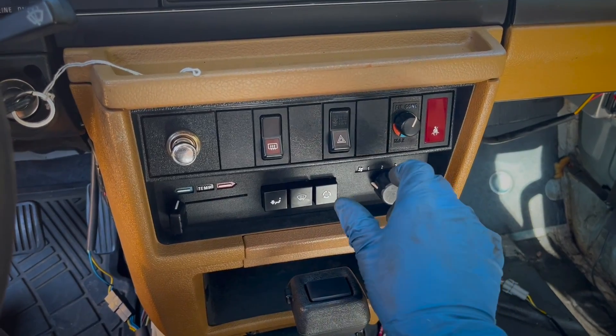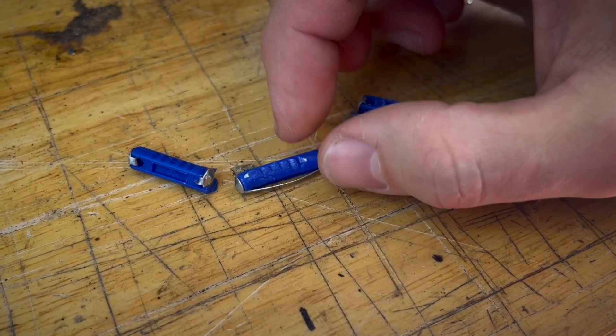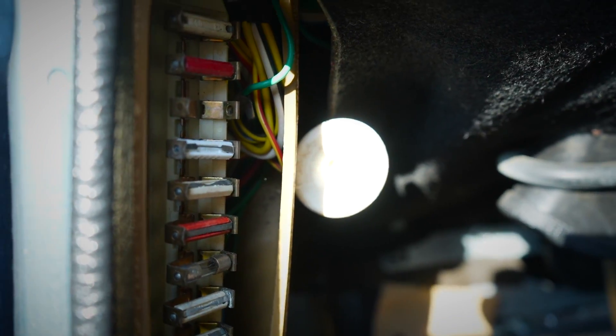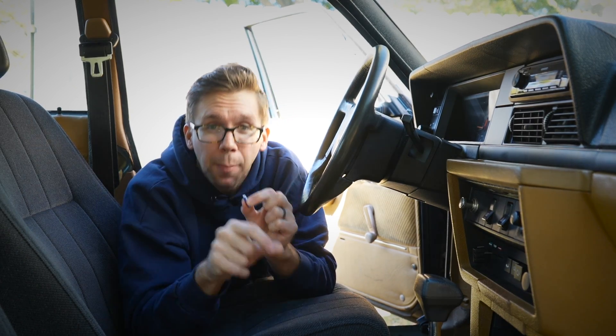So if you've got some melting fuses that aren't actually blowing, we're going to tackle that today. Whenever I crank the blower motor on this car all the way up to four, it shuts off like it's blowing a fuse. And in a roundabout way it did — sort of. It melted. Task failed successfully. The fuse element hasn't blown, but the plastic fuse body around it has started to melt. On the day it melted it was cold out, so I just slipped another one in there and spun it around. That's your first little trick: since they only have two points of contact, you can also pinch the little brass fingies together to make it grab the fuse tighter. Be warned though — a lot of times when you pinch these, it'll end up trying to pop the fuse back out another direction. So take that tip with a grain of salt. Just make sure it's snug in there, like a bug in a fuse.